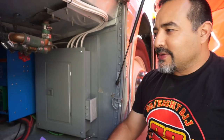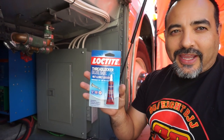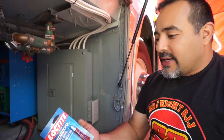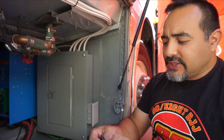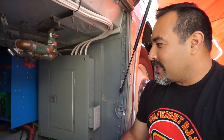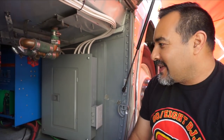This morning we're working on the inverter connections — applying blue Loctite. Apparently blue Loctite now comes in a red container, which was confusing. We're putting Loctite on the nuts to make sure they stay tight and don't move around. We're also putting a piece of rubber around one of the contacts so that if it breaks or loosens up and the cables accidentally touch, they'll hit the rubber instead of causing a metal-to-metal short, arc, or fire. It's really cramped in there, so Michelle is mostly doing the work using a mirror and screwdrivers.